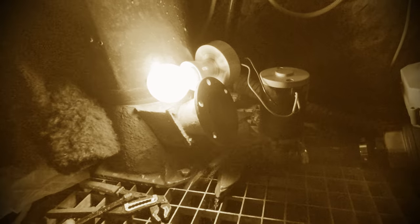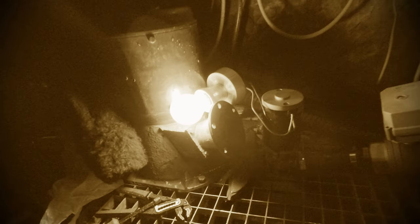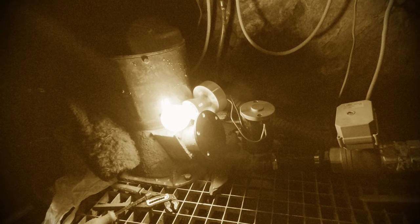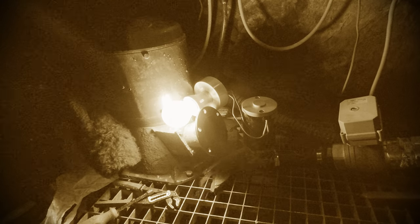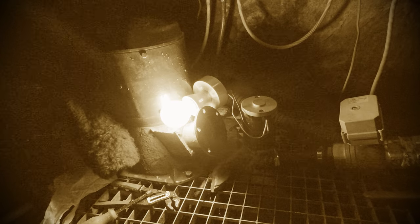I think the rated output of 300 watts is probably a little bit creative. I'd say that was showing about 25, maybe 30 watts output, which is cute, but it's better than nothing — actually more than I thought it was going to do. My conclusion is that this 300 watt AC hydro turbine is actually a 30 watt DC pump being deliberately missold. In all truth, I'm not even remotely surprised. However, it does actually generate electricity and maybe could charge a leisure battery on a camping holiday or something — so it would be wrong to say it's totally useless, but it almost is.